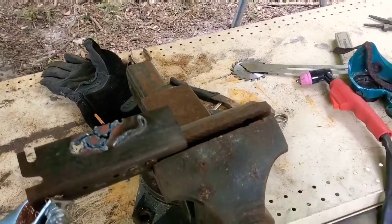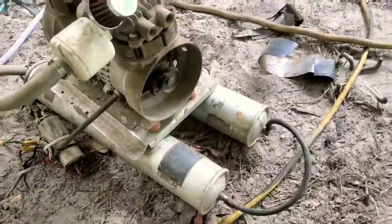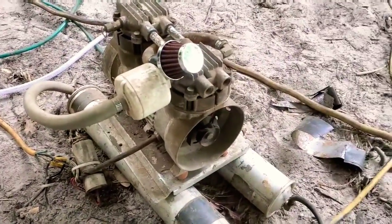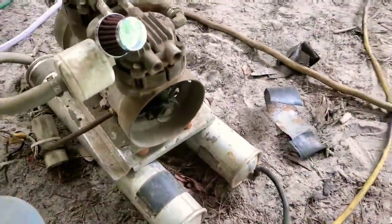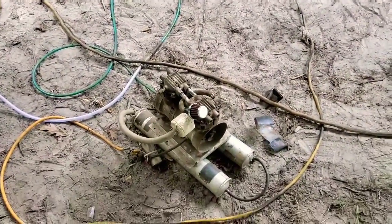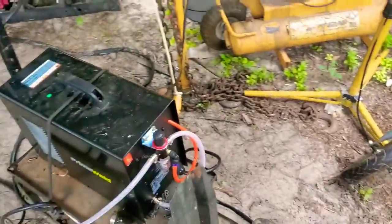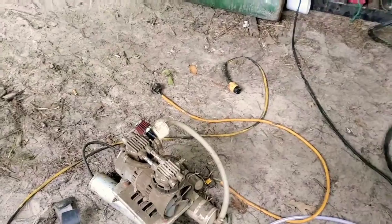I tore apart an oxygen concentrator that was on the property. As soon as I turn on my compressor and as soon as I turn on my plasma cutter, I can immediately start cutting. Now if you use different tanks other than the ones that came with the oxygen concentrator, I'm not sure how this will perform — I've only used these tanks. But even without the tanks, you could probably hook this directly up to your plasma cutter and cut just fine. You're able to build up a little bit more pressure when you add the tanks, but if you added a bigger tank, you would have to wait for the pressure to build up and you wouldn't be able to constantly cut. So for what I'm doing this is perfect — you can start cutting immediately after you plug it in.